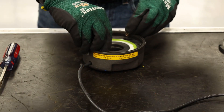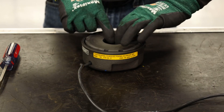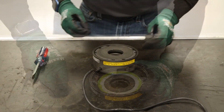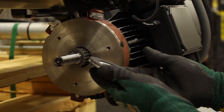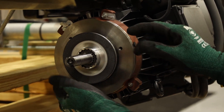We recommend you replace all torque springs at the same time. Place the new springs in the coil. Replace the friction plate, aligning the two holes directly opposite one another with the screw holes. Replace the two screws and tighten them evenly until they are each hand tight. If you changed the brake hub, first replace the hub and snap ring on the motor shaft.